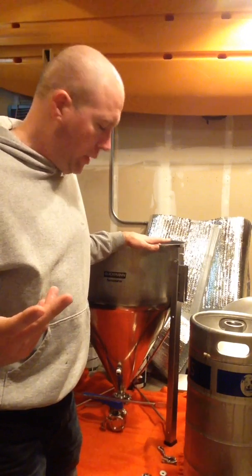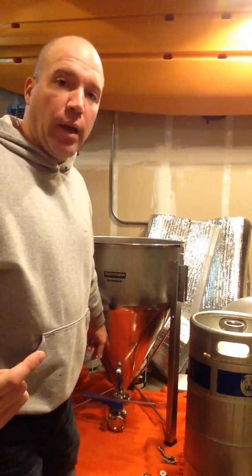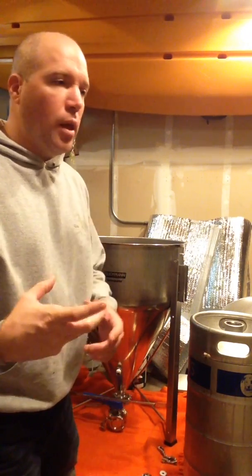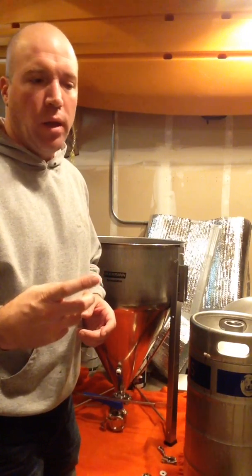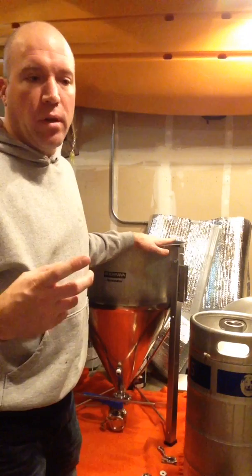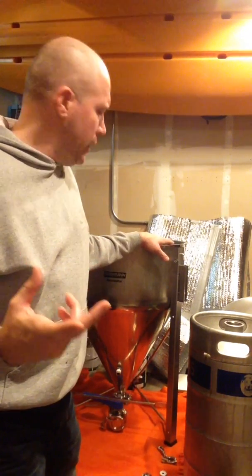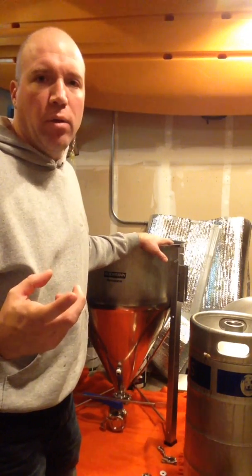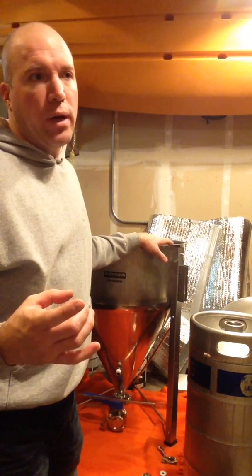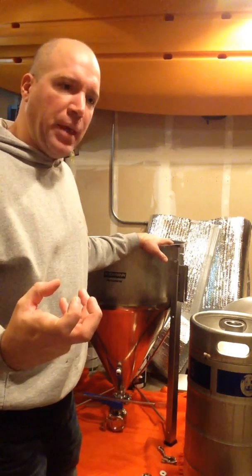It's not that hard, it's actually pretty easy. The only hard part is that you have to make like a one-inch bore on the bottom hole — the hole that the National Pipe Standard version comes with. I think it's three-quarter inch, so you just need to make it a little bit bigger, to one inch, for the tri-clover, because the tri-clover needs a bigger hole to fit that piece.